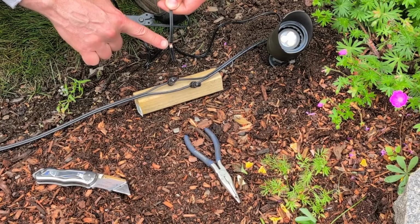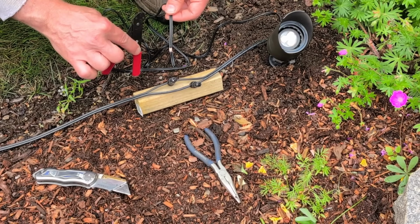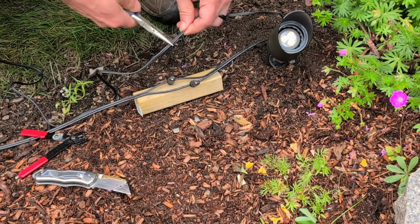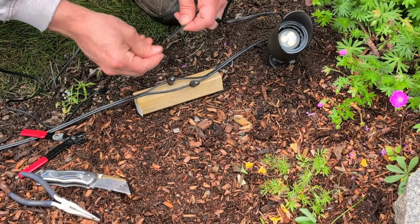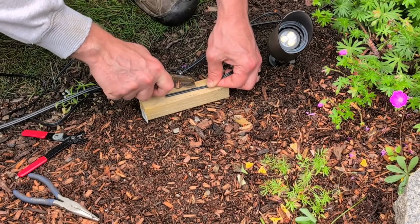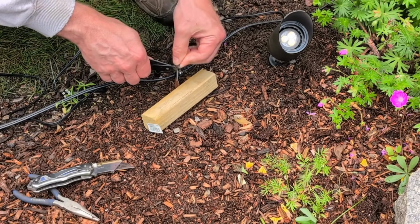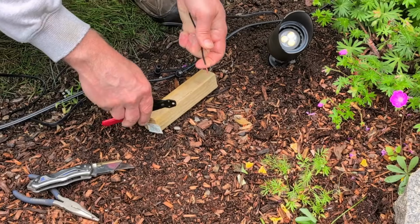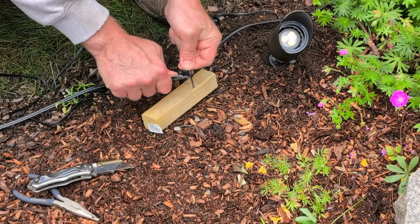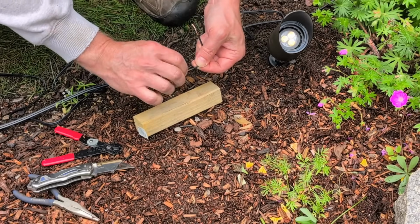The wire that's provided comes pre-stripped, but we need to cut it shorter. So because of that, we need to re-strip the wire. Just pull off whatever length of wire that's needed, and then use wire cutters to cut it. And then separate the 2 wires like we did earlier. And because we cut the wire, we have to re-strip. And now we're just twisting the copper strands so that they don't go everywhere.